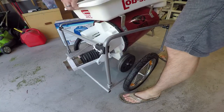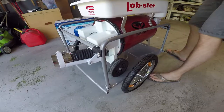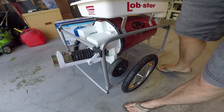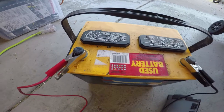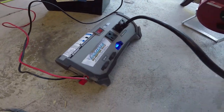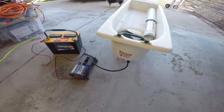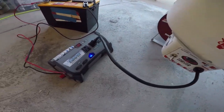The actual tennis ball machine fit pretty well inside the trailer with minor modification required. But the first issue we ran into was related to the power. The original plan was to power the unit from an old truck battery I had sitting around with a 400 watt inverter. After several trials we figured out that there wasn't enough power getting to the unit to actually power the fan itself.